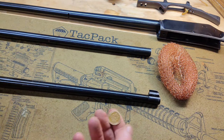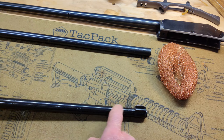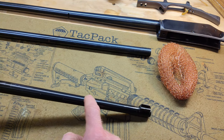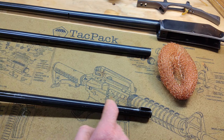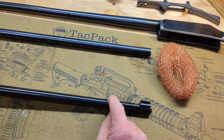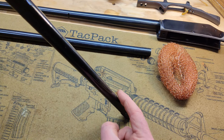So the first technique is the penny. And right up in this area, if you run your finger across it, like I'm doing, you can feel the bumps and ridges where the rust is in the bluing. All you do is gently take that penny, put it under your finger, and just roll it back and forth